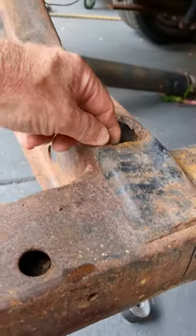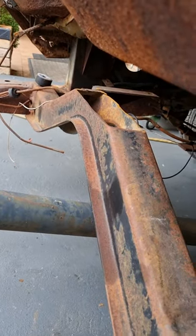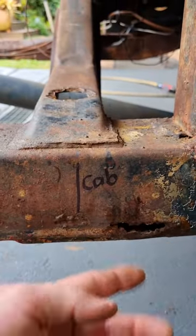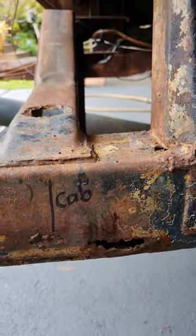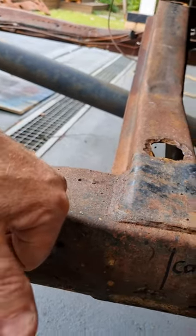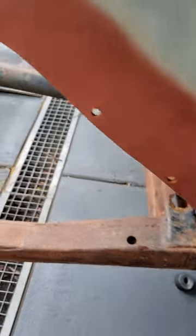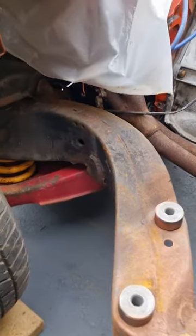So a couple of things, got this out, you can see chassis rusted there, that's okay. I'm going to go through, cut that section out, put a new plate in. I can box the top of that where I cut it previously. This isn't actually rust, but I'll go through and fix things like that up. There is some rust in the bottom of the frame here. The frame's not too bad. I'll go through and pick it out. There is some spots of rust in it. It's actually got a lot of dirt and stuff in it, so I'll give it a really good clean out. I'll make it all good. I'll go looking for problems and then fix them. But overall, I think it's okay.